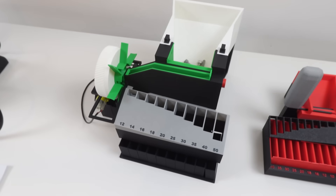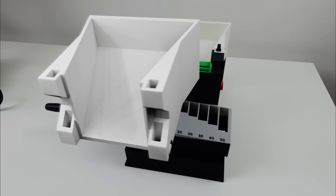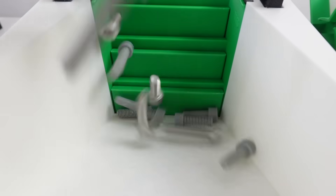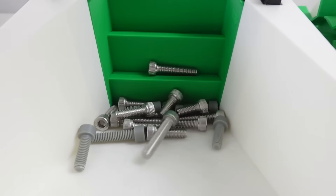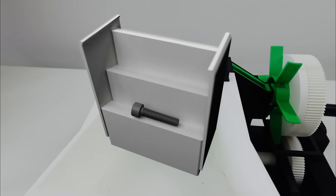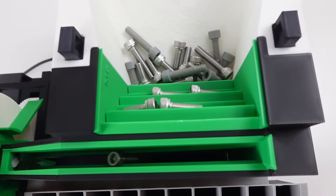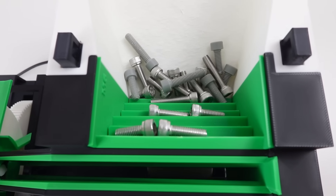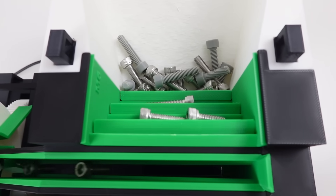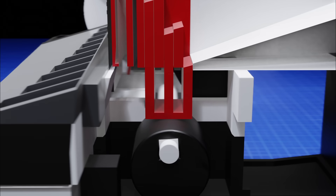Its function is very similar, but let's take a closer look at its components. This is the hopper, a large container with a ramp where you drop in your unsorted screws. Currently they're just a chaotic pile. From there they get picked up by these moving walls. This step is necessary to separate screws from the pile and give them a rough orientation, as it's almost impossible to sort them directly from the pile. They are powered by an eccentric cylinder that moves the walls up and gravity pulls them back down. The walls and the cylinder aren't connected, so you can quickly change them out for different sizes.